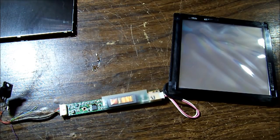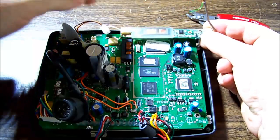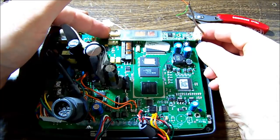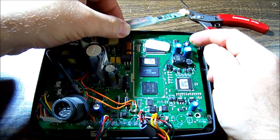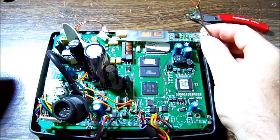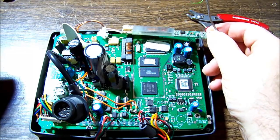All right, now I need to find where on the main board we can have a 5-volt rail that comes on when things are running, and then find a way to tidily mount this driver in the case there. Well, this might be quite perfect. Here's the original connector, and if I line that up with that, then the length of the board just mates with the side of the PCB. So this is going to fit inside the case quite nicely. I'll probably put some foam padding or something underneath that. I might even get tricky and make a little metal bracket to come off the screw post here and mount it to the screw hole here, just for a bit of extra stability and ensured grounding, and we'll see what happens.